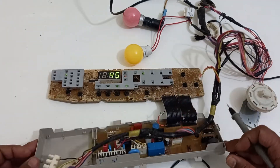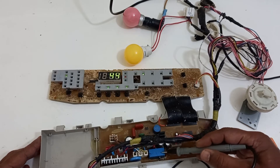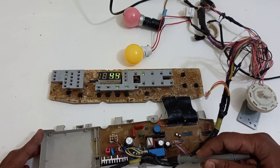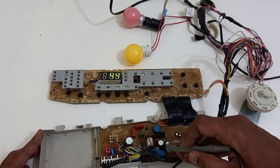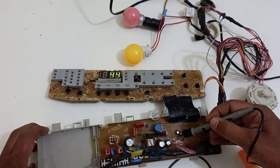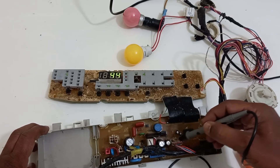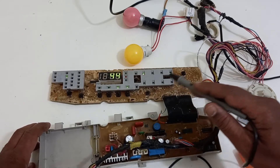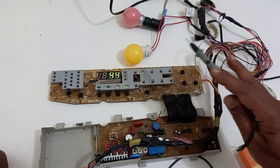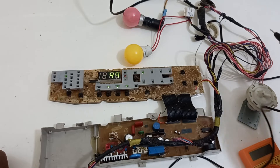I can show this from the other side. This is the 100 kilohm resistor next to the relay, another 100 kilohm resistor, and another resistor here. This is a 1 kilohm resistor after the transistor. If any of these components is defective, this condition appears — the PCB shows everything is working, but there is no output at all. This is the coma stage.